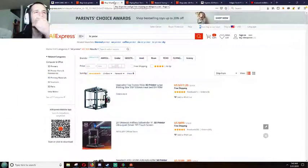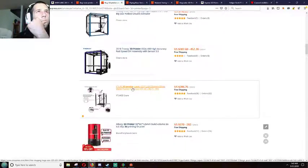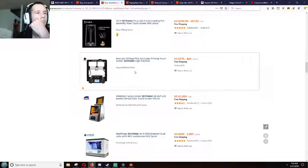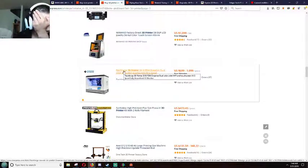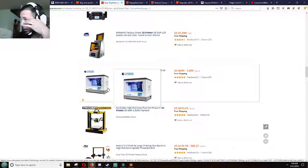All right, what's the difference? Look at the machine parameters. Nozzle diameter is 0.4, but then above that you have layer thickness 0.05. So how does it go from 0.4 to 20 times smaller? The nozzle diameter is how wide the nozzle is. Your layer thickness is height. No, I understand the layer thickness of the model itself. But what do you mean nozzle diameter? Is it the diameter that the plastic comes in, or the one that the plastic comes out? Out. Okay.